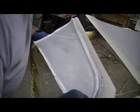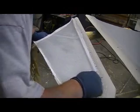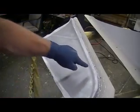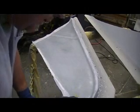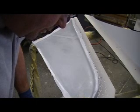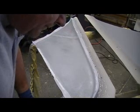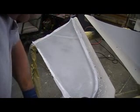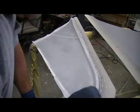It's better to take your time and cruise on it and not get in a big hurry. Make sure you've got all your edges good — you want that resin to go up on that edge a little bit. When we trim this, do not let it set all the way up. If you just walked away and came back tomorrow morning, this piece would be scrap — you could not use it. I'm going to make another video when it's exactly time to trim it.